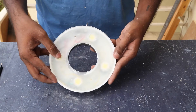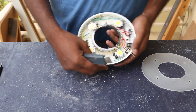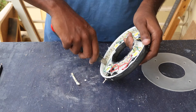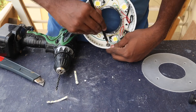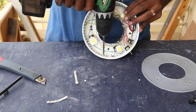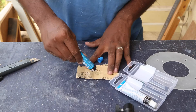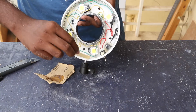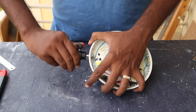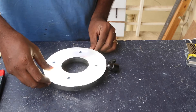On one hole I had initially planned to drop in the ball head, but I put the DC jack there instead, so I needed to make some space. Luckily, I could cut out a little of the LED strip at the designated mark to make room. This is the ball head I'm going to use — I bought it for 150 rupees. After marking the nut placement and drilling the hole, I made two-component araldite adhesive and carefully added it just around the nut. When it was half-dry, I removed and reseated the ball head to clear any excess glue.